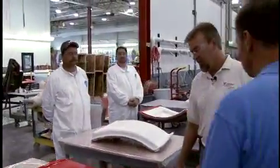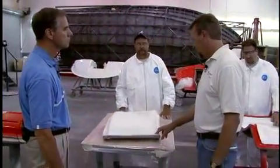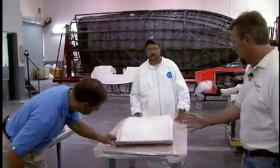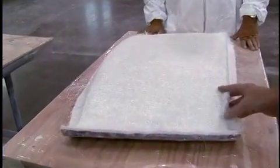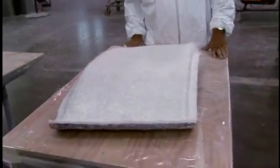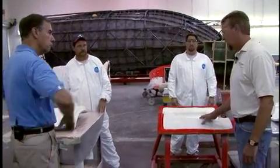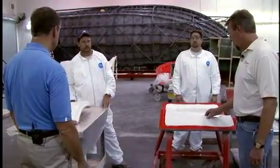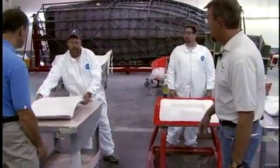This is a 350 storage lid — at the back of the boat. We gel coat each part, then we lay fiberglass in that actually forms to the shape. At this point we also load the outer mold with glass after it's been gel coated. So both parts are prepared at the same time equally in terms of lamination. Then we introduce resin into the outer mold.